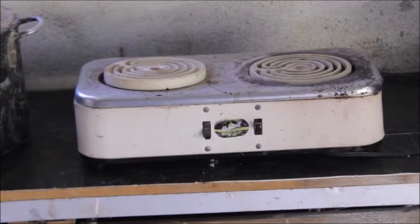All we're going to do is dead simple. One thing you can do is just take this hot plate and get a clay flower pot - make sure it's the clay type. Find a flower pot that'll just fit over the top of that burner, it'll just go down over the burner. You set your mold on that burner and you put that clay pot over your mold.